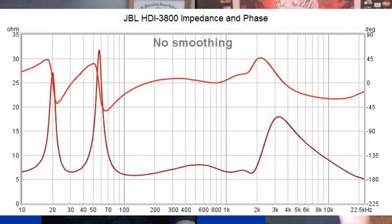I want people to realize: when you buy a speaker rated at 8 ohms, that's a nominal average rating. Looking at an impedance curve for a speaker we just reviewed — this speaker dips down to 5 ohms in areas where you can consume a lot of power. Right at the saddle point of a tuned system, if you don't have a stout amplifier capable of driving a 5-ohm load at volume, you're going to run into problems. That's why it matters what an amp does at both 8 and 4 ohms.